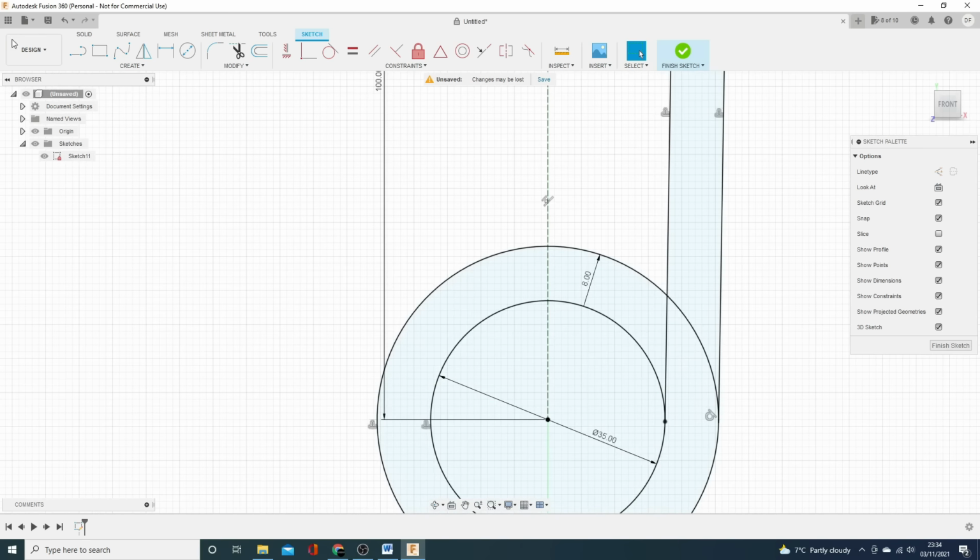And then I'm going to bring this point, I'm going to make that coincident with this circle. And there you go. So that's now, again, fully constrained, lovely. So we're going to bring in a circle down here, which is going to be basically the hook. So we'll make that 35 mil. I'm a devil for this, do it all the time. I never turn off construction lines.